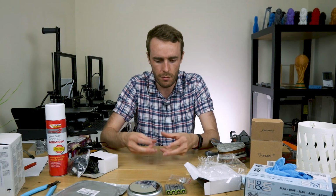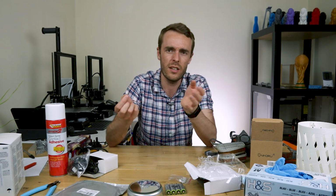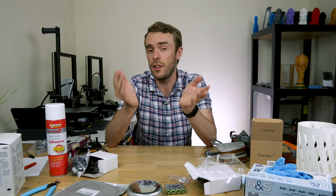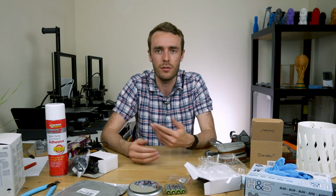Yet when the resin is in the bath with the lid off for just a couple of minutes, it develops this thick skin on the top, which comes off really easily. It's not a major problem, but it's going to be wasting lots of resin over time. I think, without having a UV meter, it's down to the fact that those LED lights that I'm using to light the area are a bright white and maybe have some element of UV shining from them.